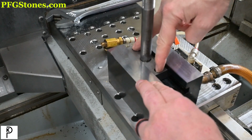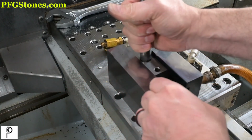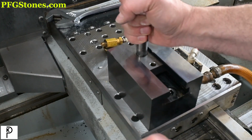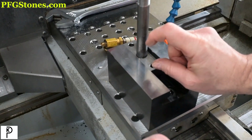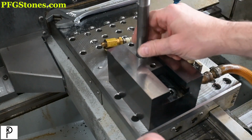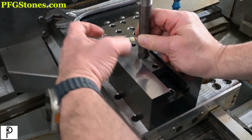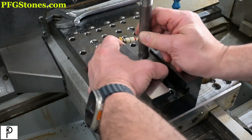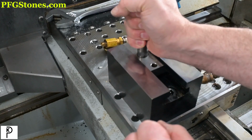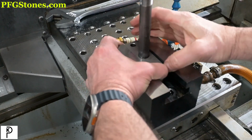The tool post is going to be pinned here, and the tool post now won't have any rotation, but it will still be able to get pushed and slid, and the clamping of the tool post is going to be preventing that. We're okay with that because that's never been a problem. And in fact, any tool pressure is going to have to push this whole thing, and we just haven't seen any evidence of that. It was the rotation that was really the problem.